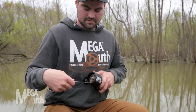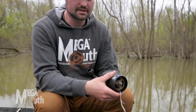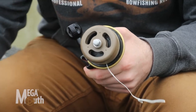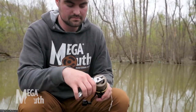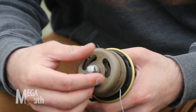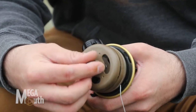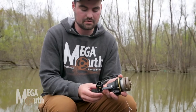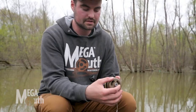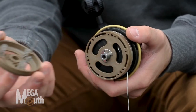So then what we're gonna do here is get some of that slack line up. I'm gonna take the cone off. We've got this front nut right here — I'm gonna loosen him and completely take him off. That is gonna allow you to pull out your through shaft here, and that is gonna come right off — front line deflector.